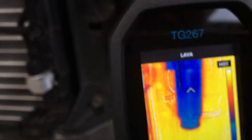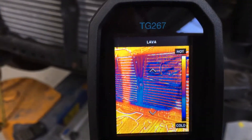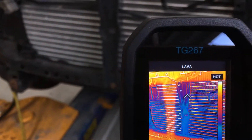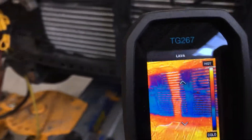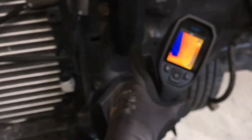You get to see the drastic differences of what is going on inside the system. Look at that receiver — it is all iced up at the bottom and sweating. This is one way of letting you look inside the system of what goes on when you lower the pressure of refrigerant — how it flashes off and chills off. There's a lot of oil down in here; there's probably an ounce of oil down inside here.